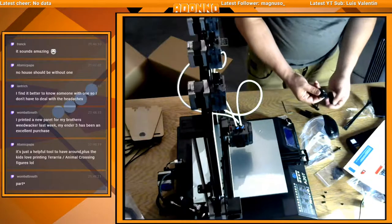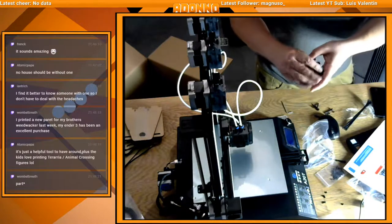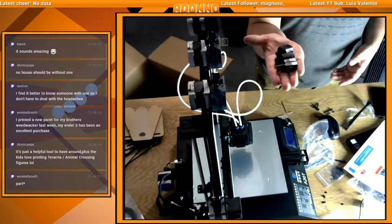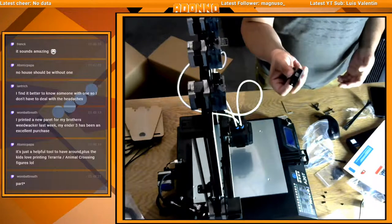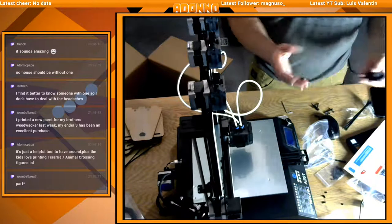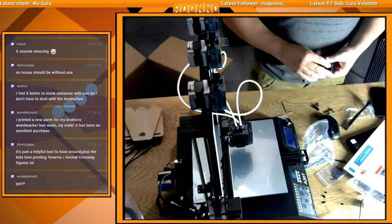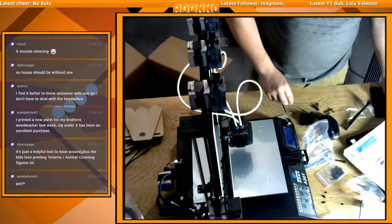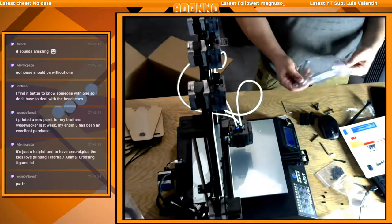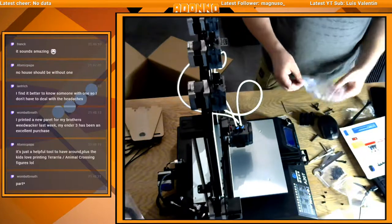Okay, what are those? Oh, end stops. Okay, no, this one, actually, that's a good thing. This printer comes with filament runout sensors. That's actually nice, and I'm quite happy to have these. I've already had prints, like 6-hour prints, or even 12-hour prints, just breaking off because of missing filament. So the printer continued printing, but there wasn't any filament. And that's when I retrofitted a filament sensor on my Ender 5, and that was one of the best things I did because it already saved my prints 2 times. So having a filament runout sensor is actually a good thing.